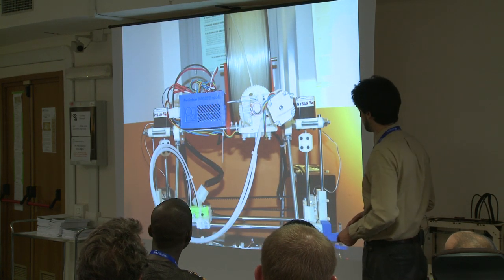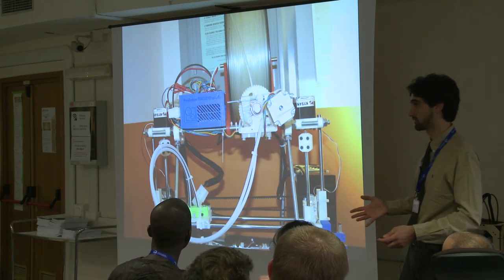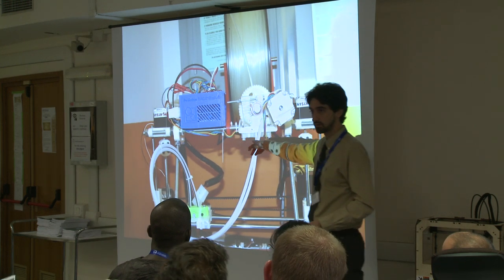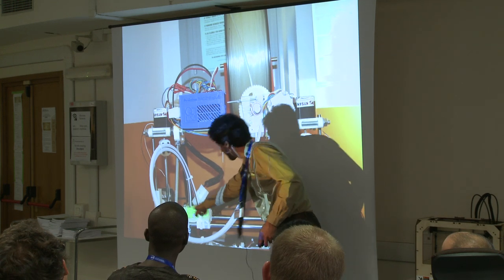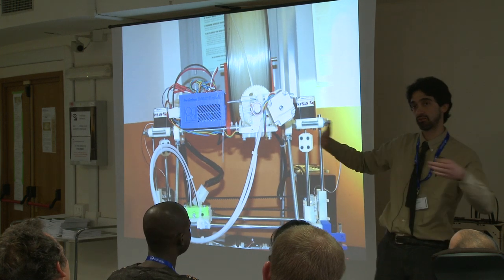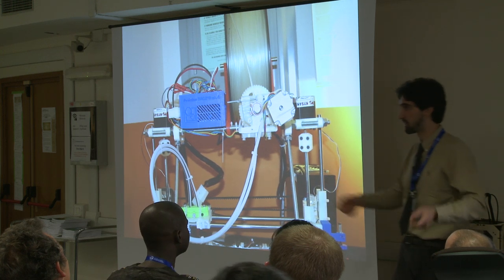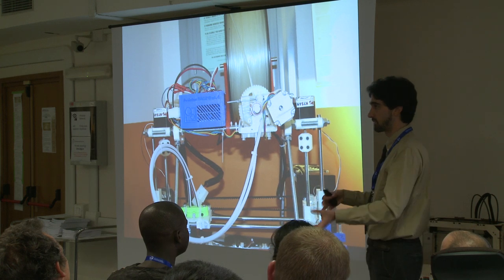This is another kind of extrusion drive mechanism called Bowden extruder. If you see, this is the drive which is attached to the frame, and then filament is pushed inside a tube, and then it comes out on the hot end over there. So it's far from the hot end. It's like the Bowden mechanism on a bike, for example, on a brake. It's like a Bowden brake.